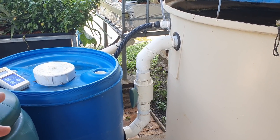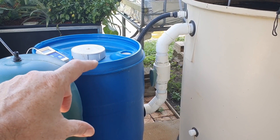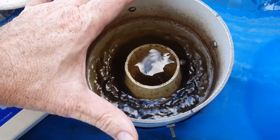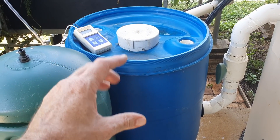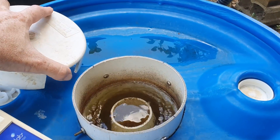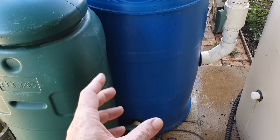Michelle has asked about the delivery of water into the radial flow settler itself. There is a link in the description if you're not familiar with how these things work. The water basically comes in down through the bottom, delivered through a standpipe inside a stilling well where the water changes direction in a larger diameter pipe down towards the base of the radial flow settler. That basically slows the flow of the water once at the top and again as the water enters into the larger volume vessel below. Michelle was asking why you can't just put it in through the top. The main reason is it would increase velocity down through the stilling well, creating a lot of turbulence down around the base which would kick up the solids.